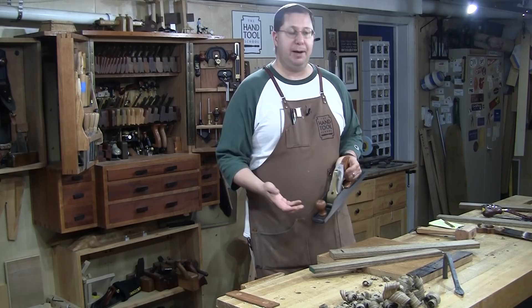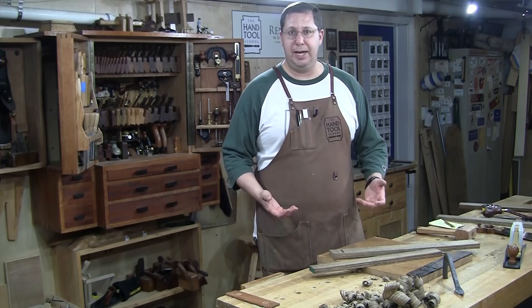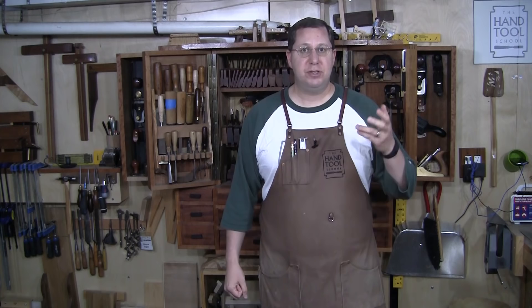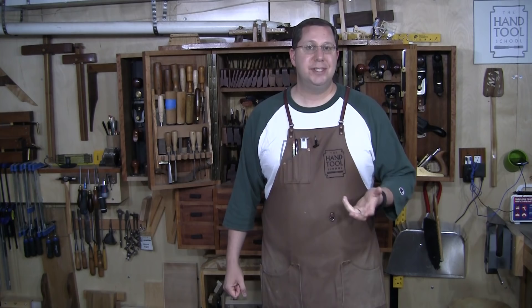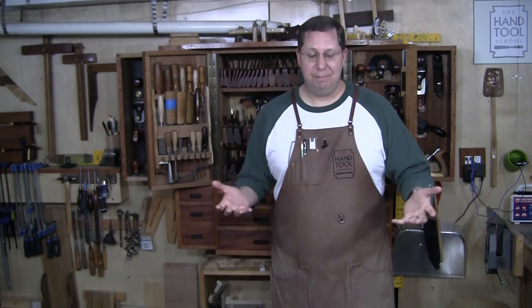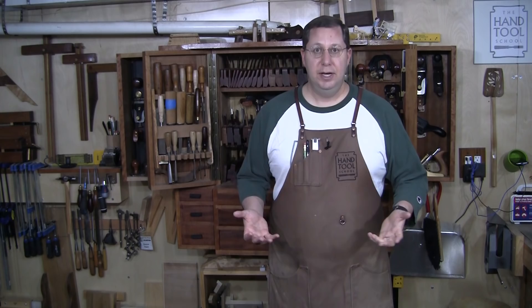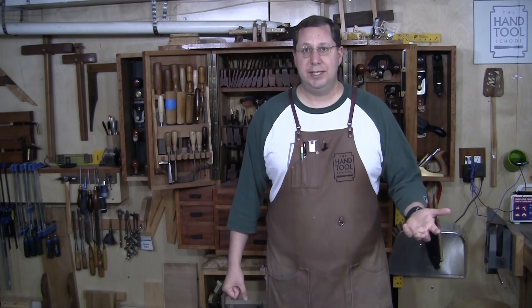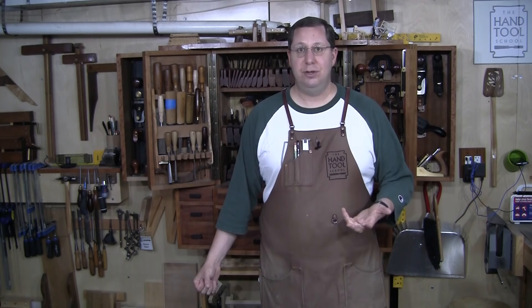And you can see, we just assembled a carcass for a wall cabinet. Now I've got more work to do on this — I've got to size and dimension the panels for my doors using my jack plane, and I've got mortise-and-knife hinges I'll be using a chisel for. The seven basic tools — well ten because there's three chisels — those ten tools and I can build an entire cabinet like this. The same thing would transfer to a dining table: it's a bigger project but it's mortise and tenons like we just showed. Or maybe a bedside table, even smaller — mortise and tenons, maybe a drawer if you want to get fancy. You can cut dovetails with a back saw, and you could even cut rabbets for assembling the drawer box using a back saw and a chisel.